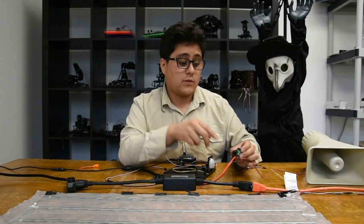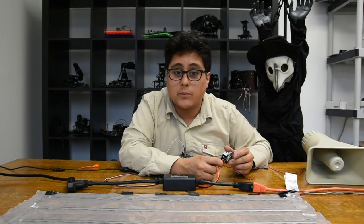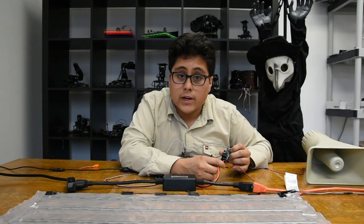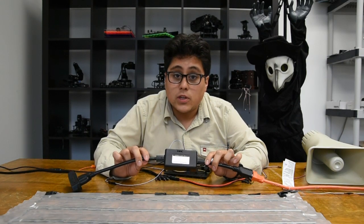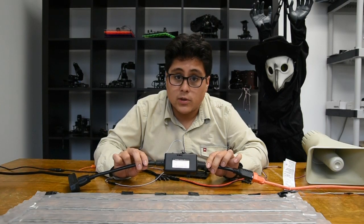For our outputs, we're going to be using this relay. We can use this relay for small voltages — anything from 3 to 24 volts DC. These are really great for powering or just making connections, like connections on a button switch. We've also got the power switch tail, which is a really big, beefy relay. You can use this to control 120 volts AC up to 15 amps.